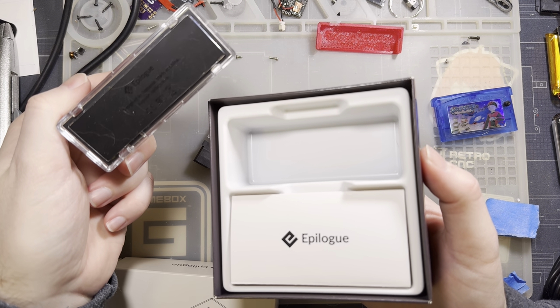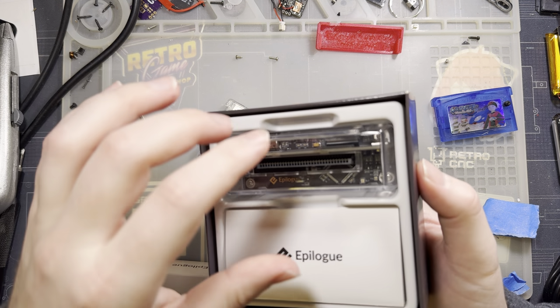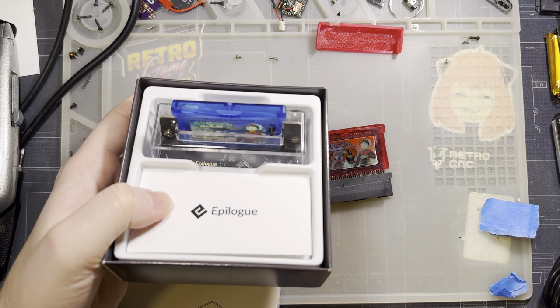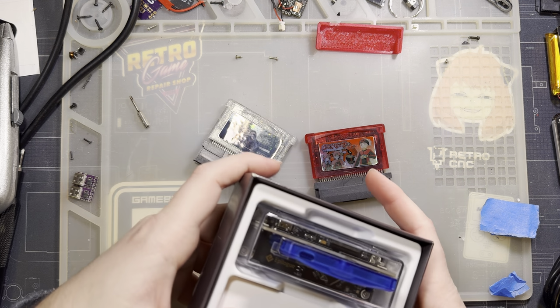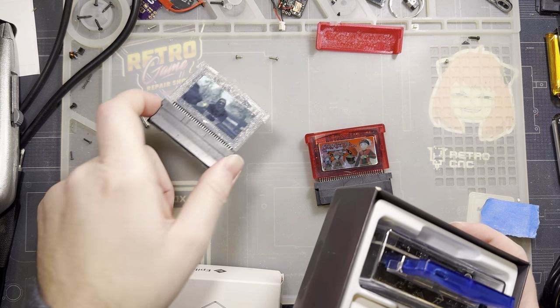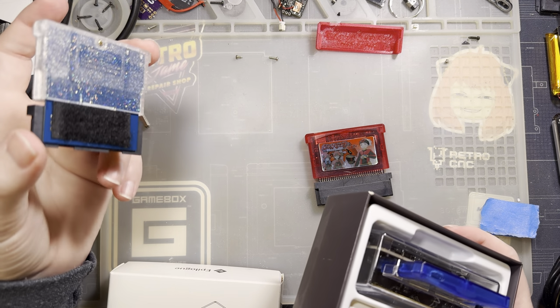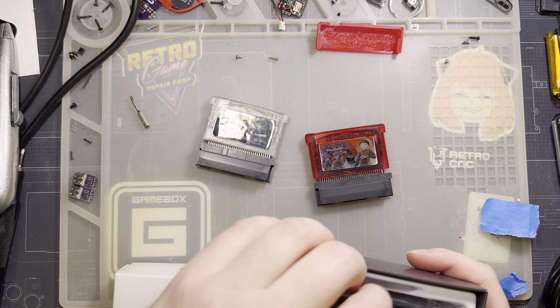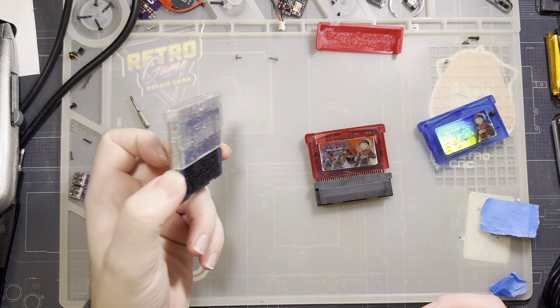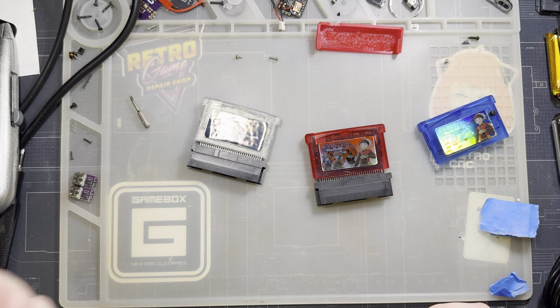The biggest claim to fame that this thing has, that I see most people referencing at the very least, is that you plug your games into it, and then you can just boot them in an emulator on the computer. This thing supports that too. There's multiple softwares that are made for this. The most common software, FlashGBX from Lesser Kuma, doesn't support that. But you just plug your games in and dump them and then boot them in an emulator. There's software distributed by Inside Gadgets, however, that does support that. You just plug it in and it boots right into an emulator. You have to install the emulator separately, but it is, from what I hear, relatively painless to set up.